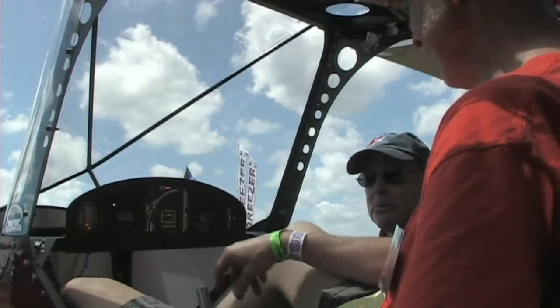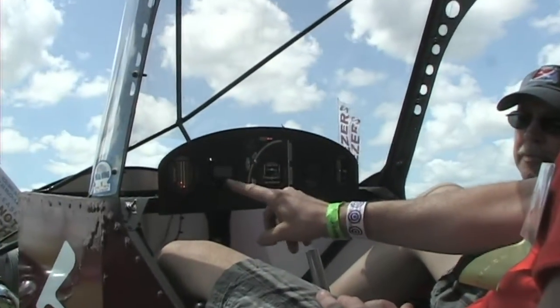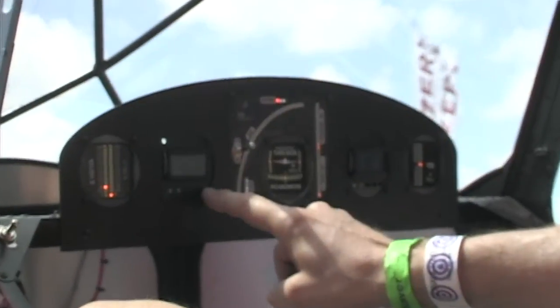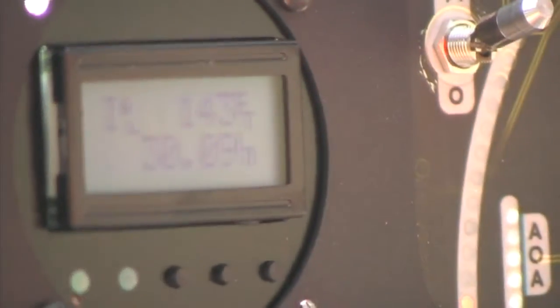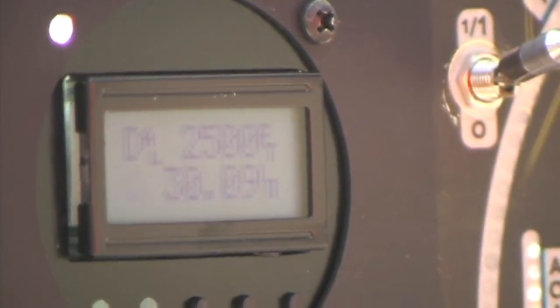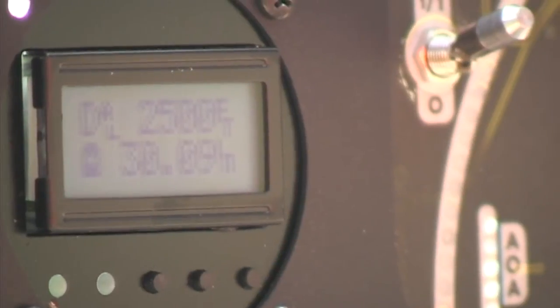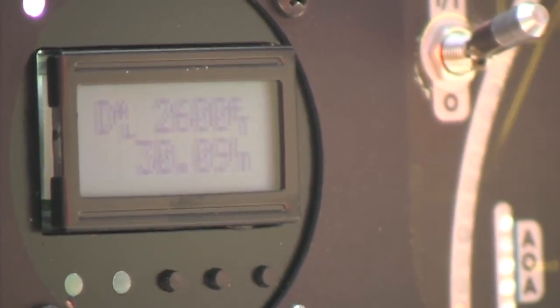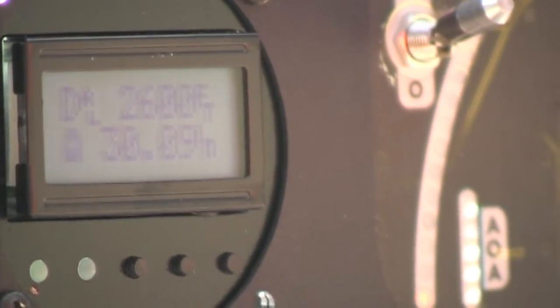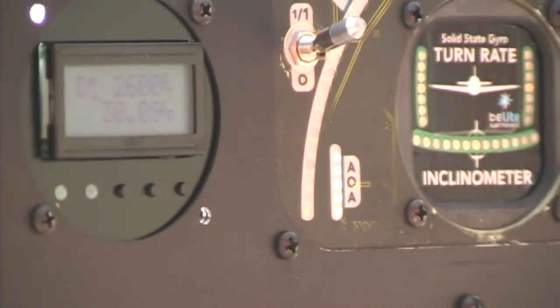We can calibrate this thing all the way up to about 175 knots. So listen to that, RV guys — with all your airplanes that can go quite a bit faster than the Ultra Cub, we can help you with that too. This is a digital altimeter. Let's set ourselves right to field elevation — it shows what altitude we're at, and it's got about ten features. I'll show you two: basic altitude, and it's foot-sensitive. Flick the button and it tells you — hey, watch out, we've got 2,500 feet of density altitude here in central Florida.